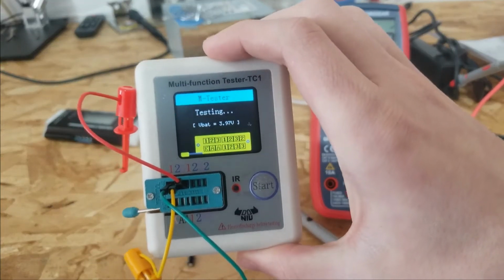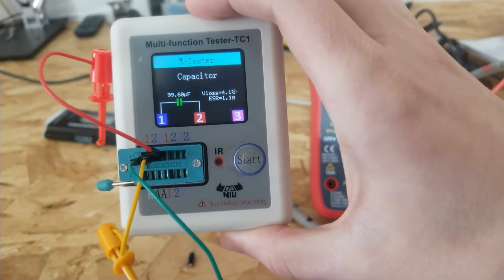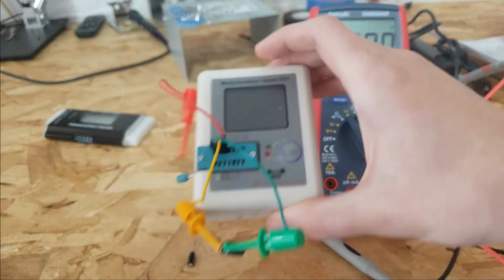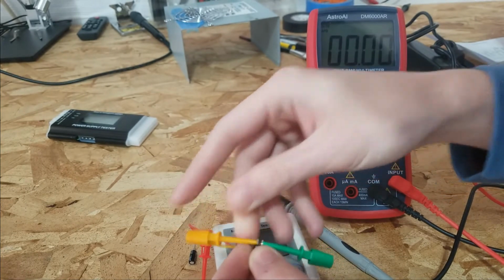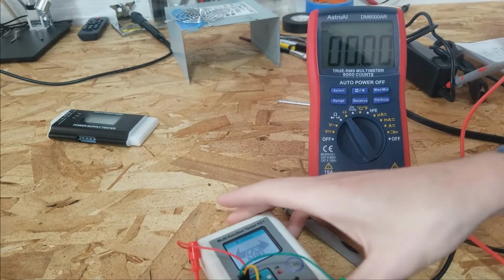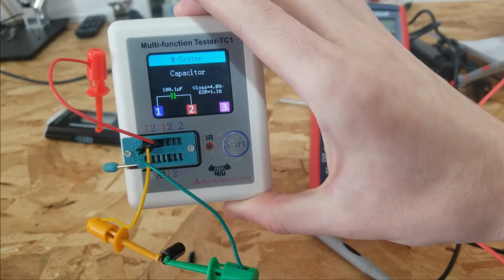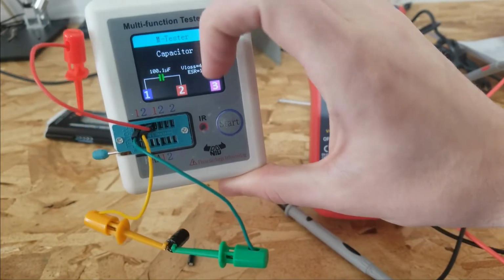But we'll see here with this terrible brand, it's about 1.1 ohms, which is not unreasonable. If I look at my ESR chart, it's about at the limit. And actually, to be frank and honest with you, it wasn't testing at 1.1 ohms before. It was testing close to the other one. So something must have happened. Let's see if, hopefully, it won't do that again. Nope. So, well, it's a little bit high ESR. Voltage loss is 4%.